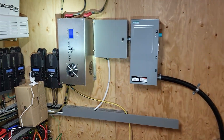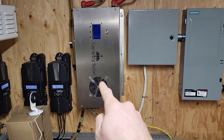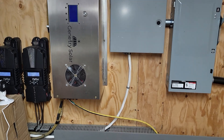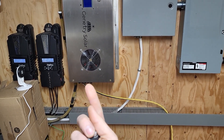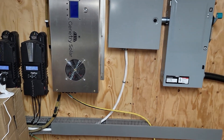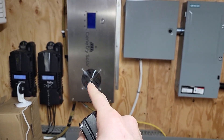One more thing I absolutely love about this Gentry Solar inverter: you can hook 120 volts to it, you can hook a 240 volt to it, it recognizes it and just knows. And then if you hook 120 volts in on the generator side, out the output — even though it's just a pass-through — you get 240 out because it's going through the little transformer in there. So it's just like having a 120 to 240 transformer built right in. That is freaking awesome.